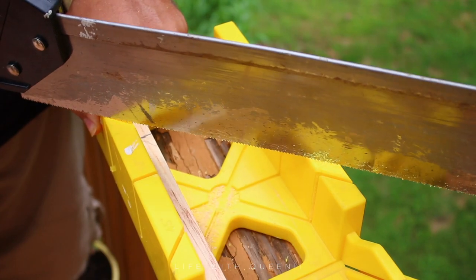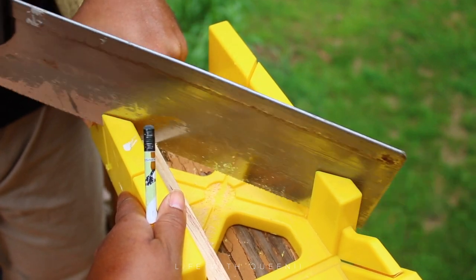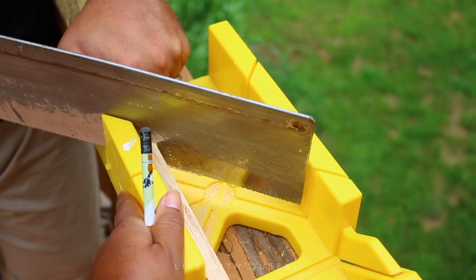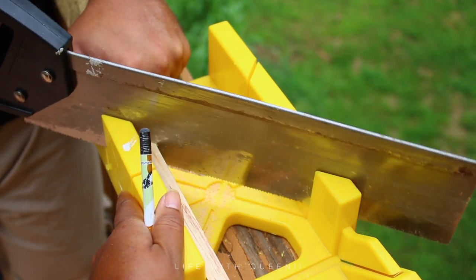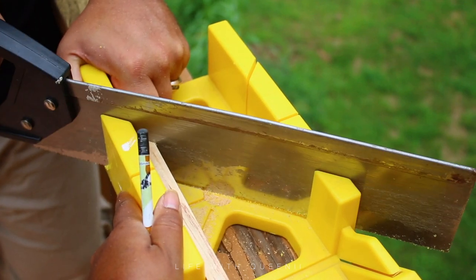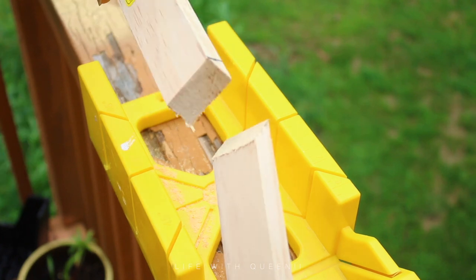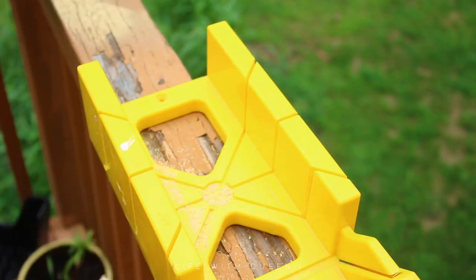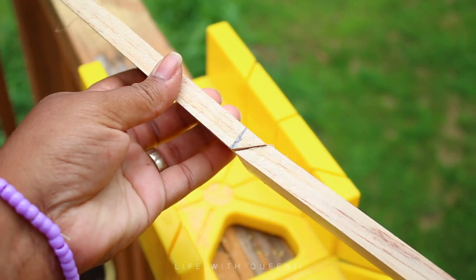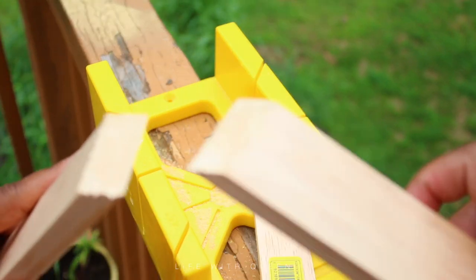Once we have this piece we're going to use my miter cut kit — this little contraption for cutting molding and making 45-degree angle cuts. I believe the kit was $20 at the hardware store. You don't have to make the cuts like this, but I wanted a little design to the desk. So we now have our 45-degree cuts, and I'll show you exactly how this will cover the edge of the desk to give it a more finished look.